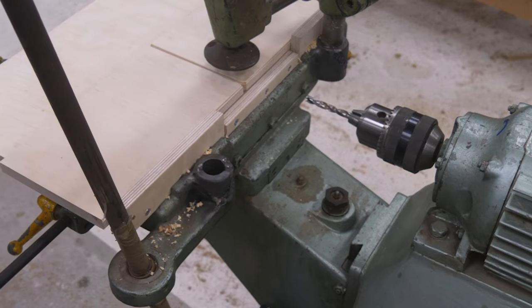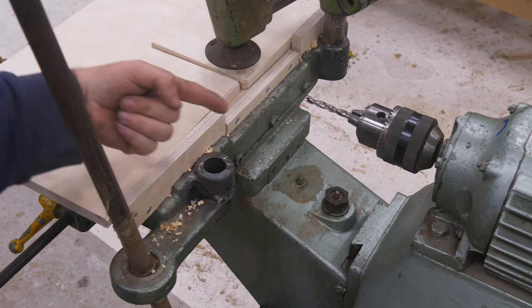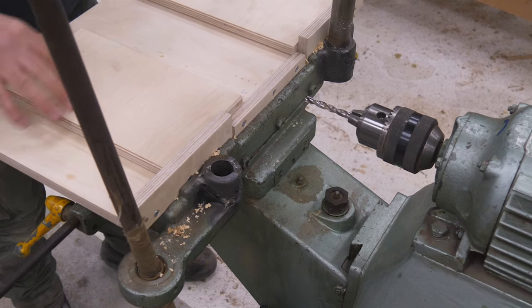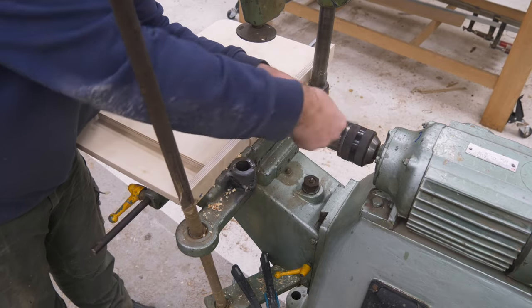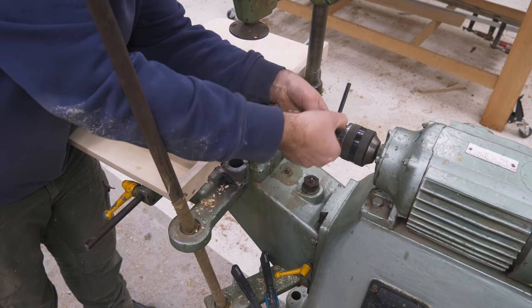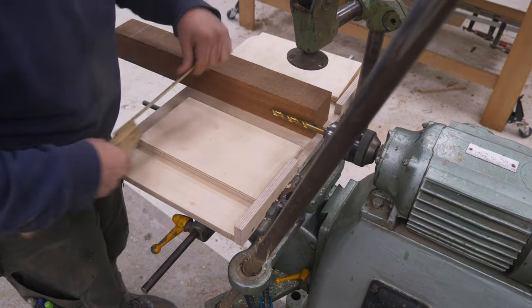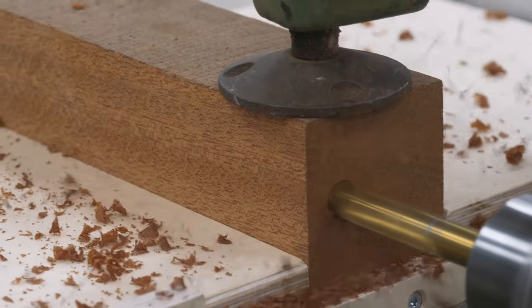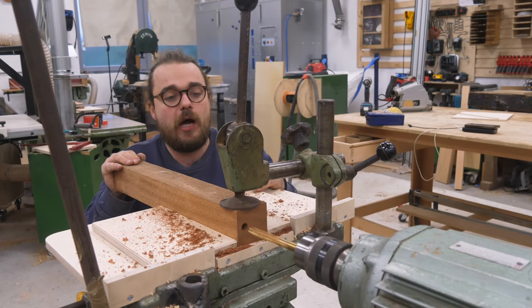The machines here are very generous. I can drill horizontally to a depth of around 12 to 14 cm, if the drill bit can handle that. We raise the extender clamp and put the stop on. We'll unclamp the drill bit and use a really sturdy, solid 13 mm drill bit. Anyone who has drilled a solid hole like that knows that 13 mm at full depth can be a bit tricky. We set the maximum depth to around 9 cm and drill. You saw it took about 5 seconds, and because it was so nice we'll just drill another hole.